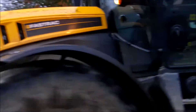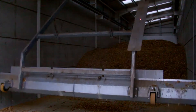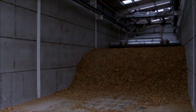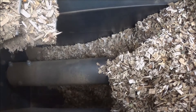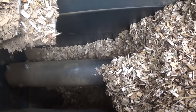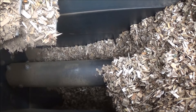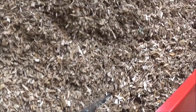That's then loaded in the bay. We've opted for a top loader mechanism, which seems to be the best because all the mechanism is above the store. If you go for a walking floor feed system or a sweeping arm feed system, all the mechanism is under several tons of wood chip and harder to maintain. That then rakes into a cross auger, which on demand turns and just loads the feed system to the boiler on demand.